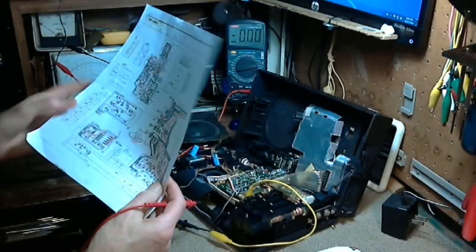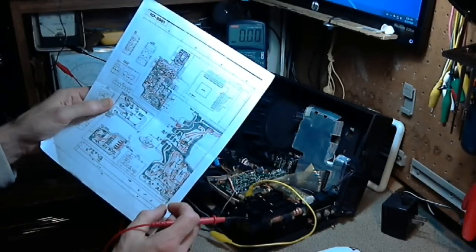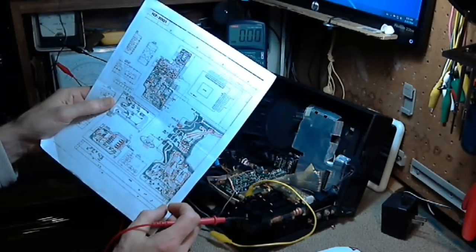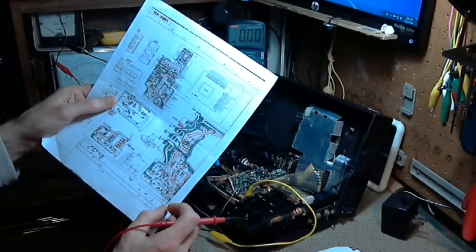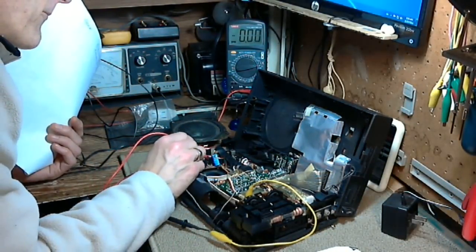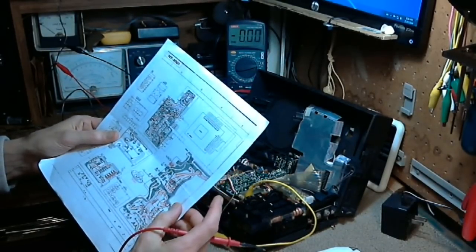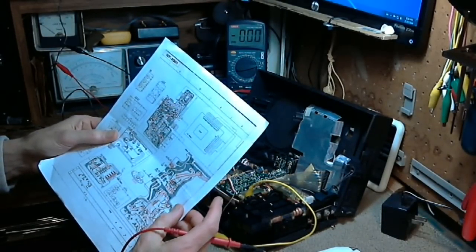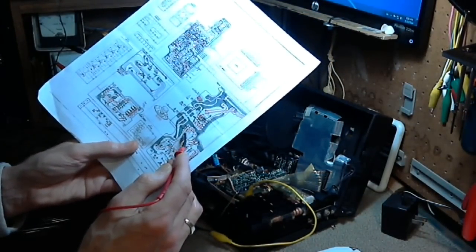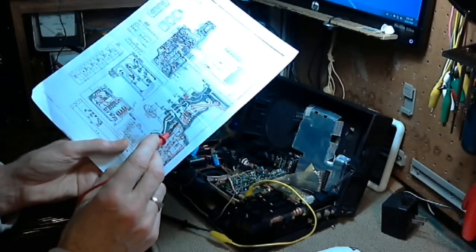Now the other transistor, the other switching transistor, which is Q26, it should read, oh, 0. I'm not sure. Should be reading 0 on this pin. And you get 0.5 there. The other two, wow. Sorry you can't see the schematic here, but just following down from collector emitter, just looking for any voltage reference here. But there's nothing.